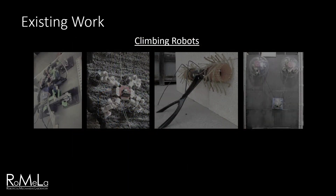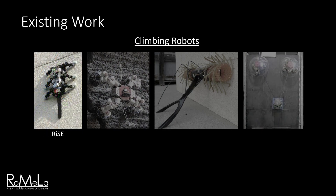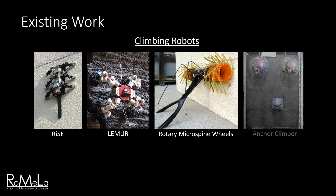Let's first take a look at legged climbing robots. Systems such as Acrobot and Rise use steel microspines to stick to rough surfaces and climb using a bio-inspired gait. NASA's Lemur takes it one step further, adding multiple degrees of freedom. These limbs offer adaptability to surface variations. Another climbing strategy is using wheeled climbers, such as this rotary microspine wheel array and this swarm robot with two suction anchors that suspend the main body. These have reduced weight since they don't need to generate a gait, but they're limited to climbing flat surfaces.